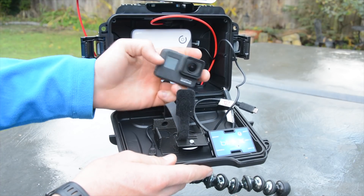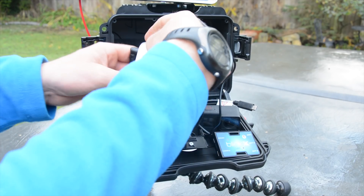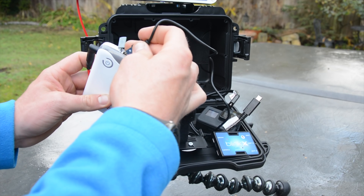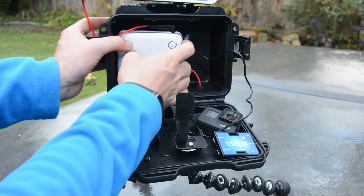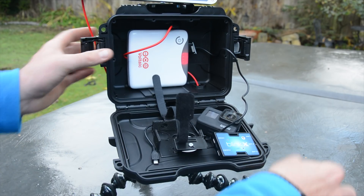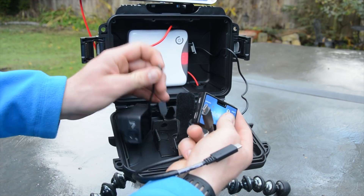The other important piece of hardware is the power supply, which is used to power the entire system. It needs to be an always-on power supply. Most battery banks are designed to power off when they're not charging — they automatically turn off when not in use, with no on/off switch. The power supply used with this needs to be always-on because for long periods of time, neither the Blink-X nor the GoPro camera are going to be requiring power.